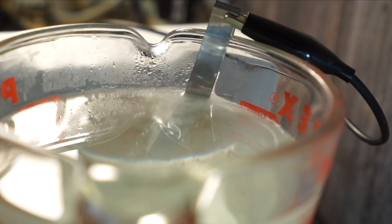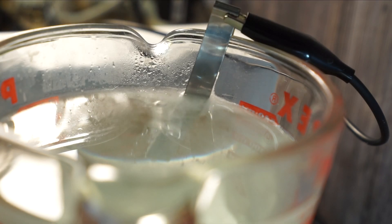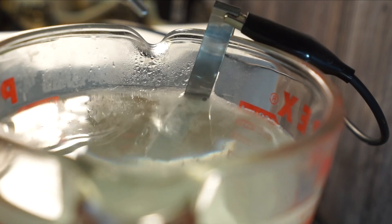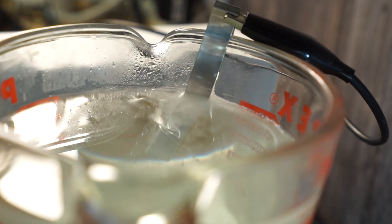Let me add one more safety note: if you notice there's a mist coming off the top, it is a little warm but not boiling at normal water temperature. This is hydrogen gas, so don't light any cigarettes near here, don't light a match or anything like that — it would be explosive. I'm just blowing it around with an air blower. Keep it away from flame or fire. It is hydrogen gas and it is explosive, but it's in such a low quantity that as long as you have enough air space or a ventilated room you should be fine. Don't breathe it in — it'll burn your lungs.